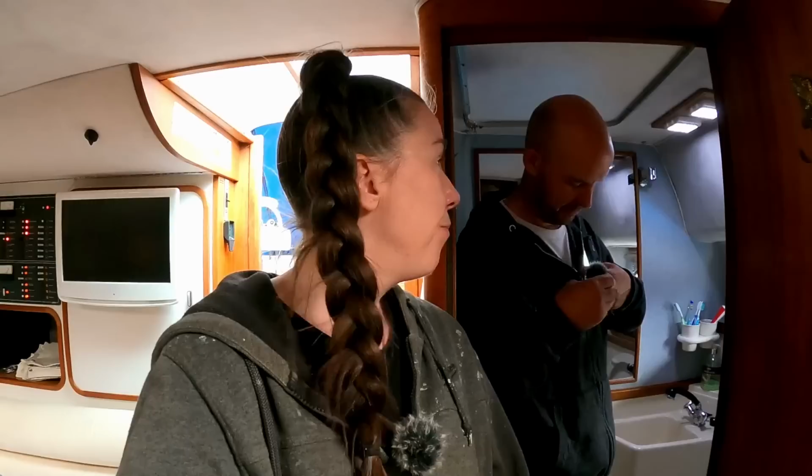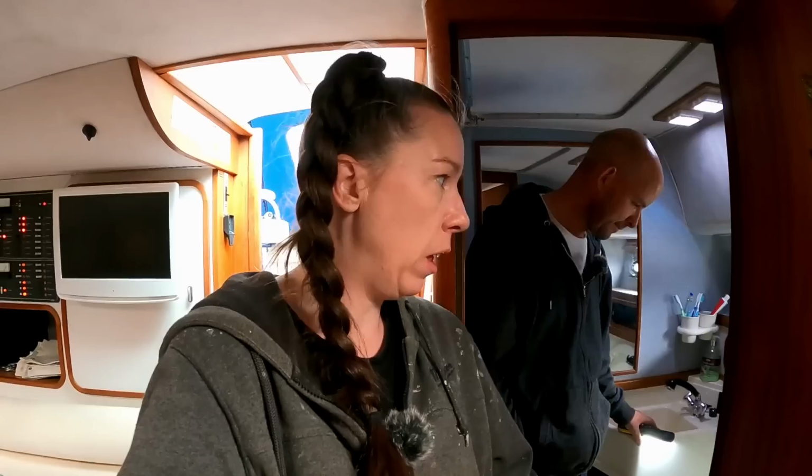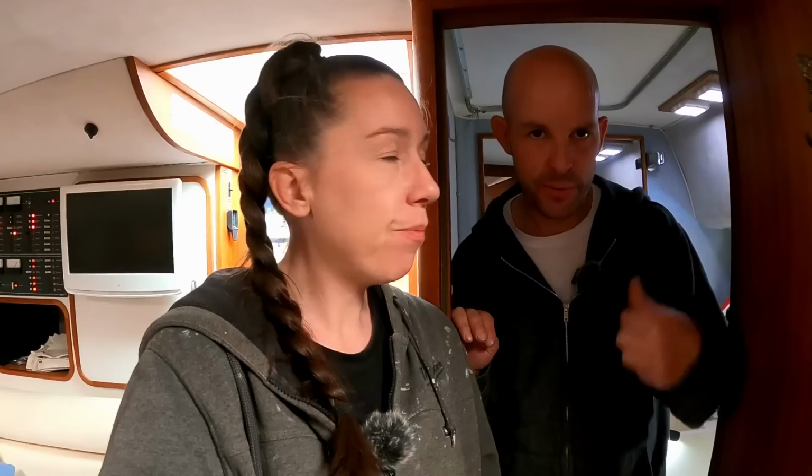Right, so it's a bit of a nasty job, isn't it? It is. Hold on, we've got a box of gloves somewhere. Let's put some gloves on, because I've cleaned the whole toilet and the whole bathroom. It's not had anything in it. We've moved some water through it, but it takes ages to get it through. So what we need to do is take the pump off, take it apart, you might find a blockage in there. We've also got a holding tank, and we don't know whether that's full or empty, so let's get the minging jobs done of toilets.